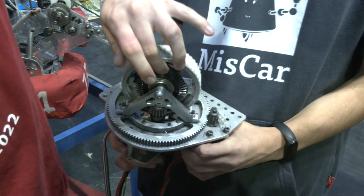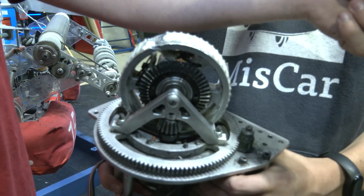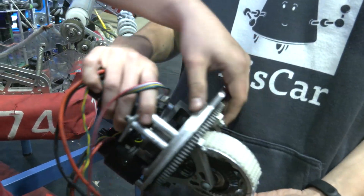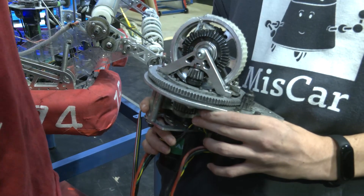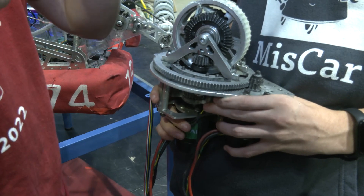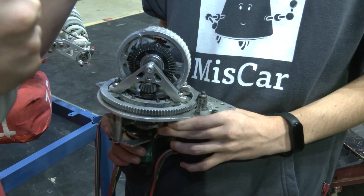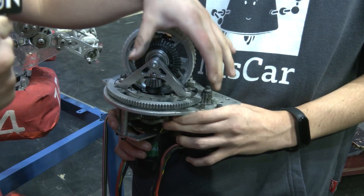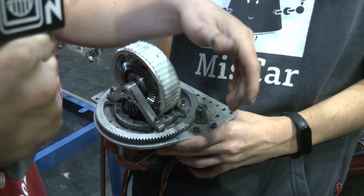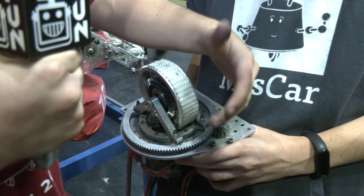Next is this embedded gear. Over the past 12 years we saw that the bevel was outside and got smashed, so we embedded it into the wheel. Then there's the triangle that holds most of the robot — we want it to be light but still strong. We used topology optimization, a type of artificial intelligence that calculates the optimal shape for the part. And for simplicity, instead of a timing belt, we used a gear system which we can produce in our shop and is easy to maintain.